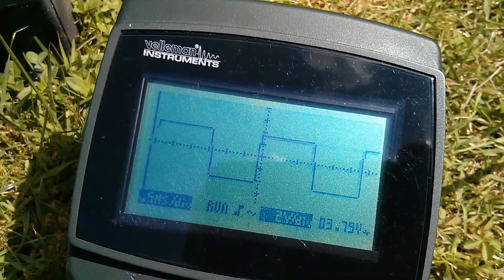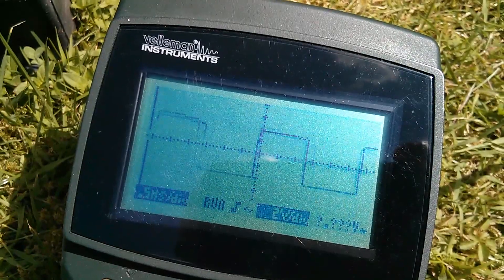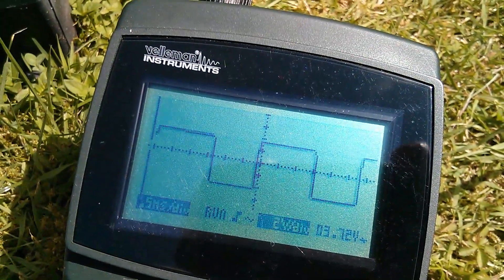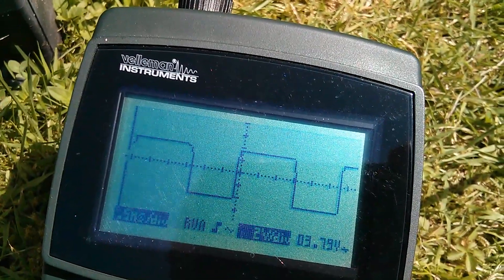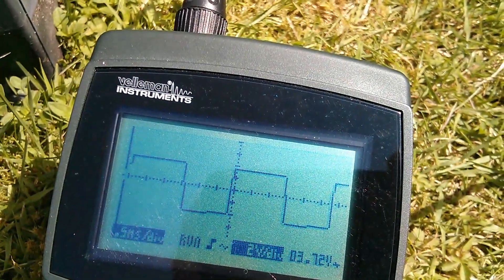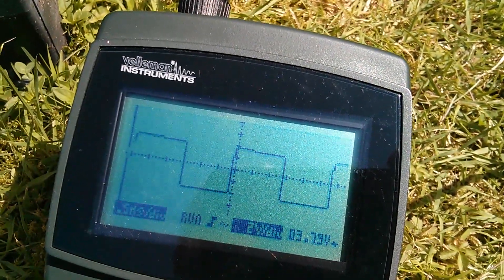This looks like it's analog — I'm not sure that's a digital circuit at all. The lower part of the trace is when the MOSFET is on, because that's when the solar panel voltage is pulled down, so it's upside down. If the lower part becomes bigger, it's turning on more. We've got some fairly good sun now, so it's at about 50% duty cycle.